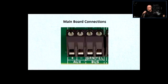Now here is the bus. Remember the bus topology? Green and yellow. So this would be using the Z type of cable, and Z cable is sometimes referred to as a security cable, right? But it's just a tiny, thin cable, 24 gauge, 22 gauge sometimes, and it just has 4 straight, untwisted conductors. And the colors would be red, green, black, and yellow.